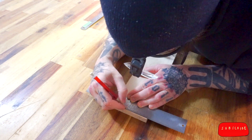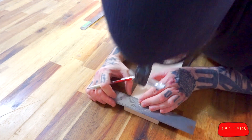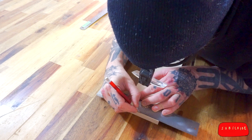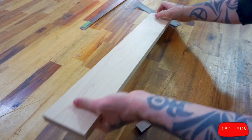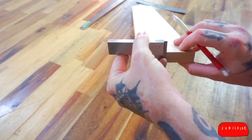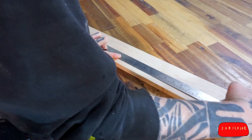In order for flip milling to work, you have to start off from a very accurate and precise center line. I'm using a centering ruler here and a very accurate INCRA pencil to mark out my centers on the top of the workpiece. Then I get my square and reflect it across both ends, and join those lines that we've made at each end across the top and the bottom of the workpiece.